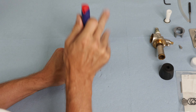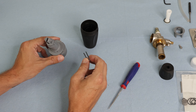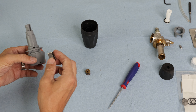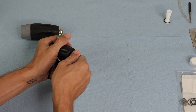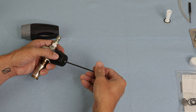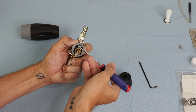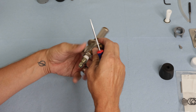Next, push the adapter out of the knob from the outside, similar to removing the filter. If the small silver metal clip comes out — also apparently called a baffle — it's a slight pain to reinsert, but not a big deal. We'll handle that on reassembly. Now we have access to three of our four seal rings. Remove the screw from the knob of the body using a 7/64th Allen key.